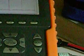And you can see the scope has a beat to it also, and that beat matches the beat of the ringing up into the drive pulses. Sorry, it's so out of whack there, but I can smooth that out, I believe. And as you can see that little pulse there, I'll try to get in on that. Sorry, this camera's lousy. But that little fluctuation there in the time of that ringing of the secondary pulses showing up matches the beat that the whole system seems to be beating to.